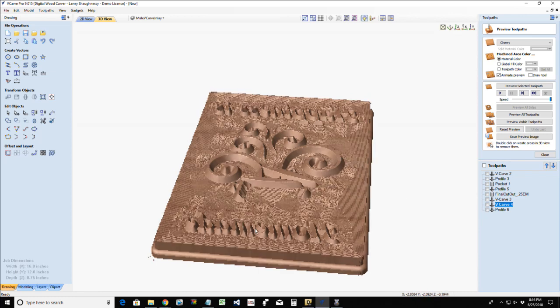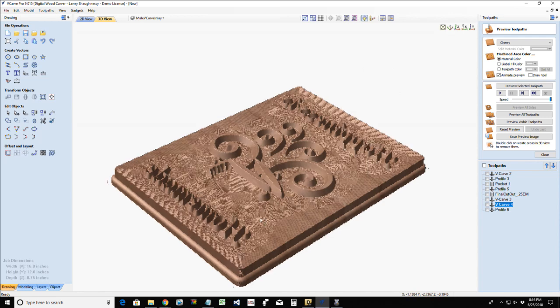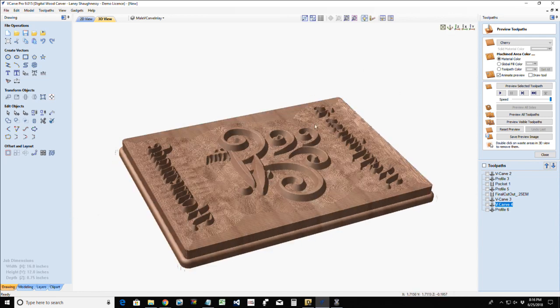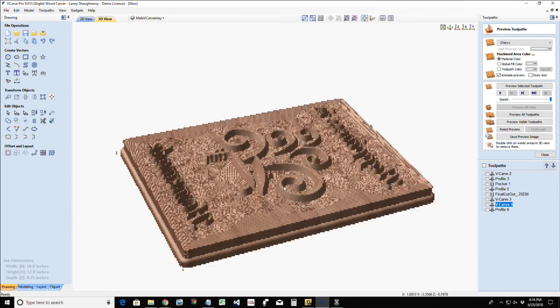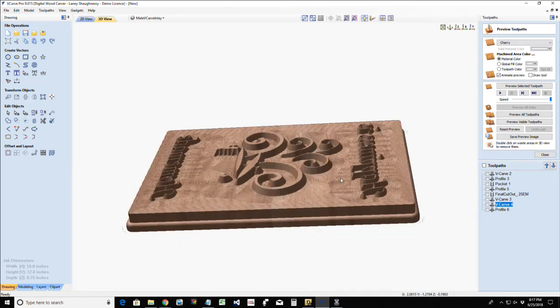The planer is very aggressive. It has a tendency to chunk and cut and tear out that end grain. You know, just rip off chunks and things. A face grain board, just a regular board, yeah, you can run it through the planer. But I do not recommend an end grain cutting board going through the planer.